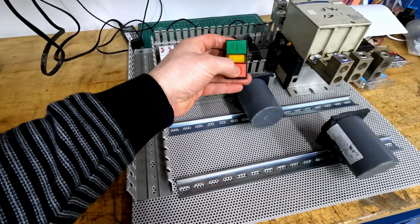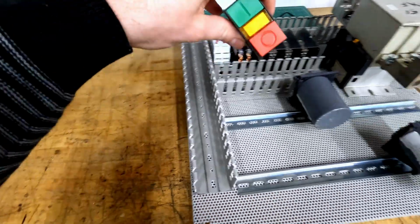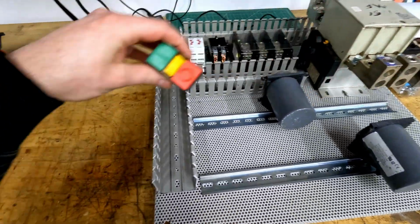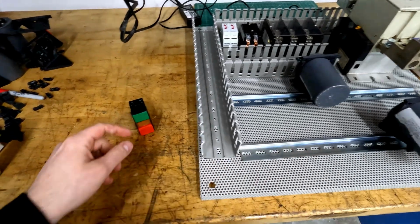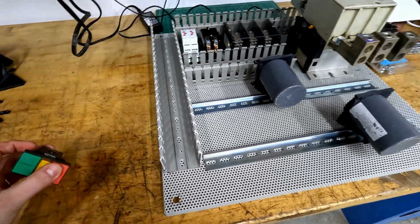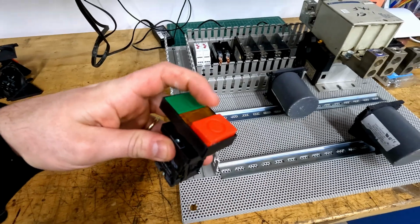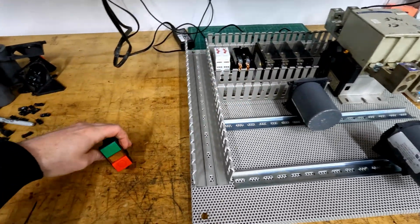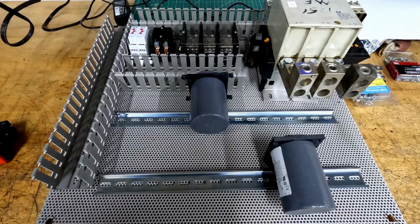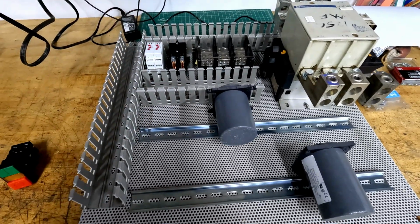For now, I'll have the main controls off to the side here, just laying on the bench. There will be one mounted on the face of the box, as well as one mounted on the wall somewhere in my shop, so I can start it either from inside the phase converter shed or in the shop. And I'll use this indicator light here on the 3rd generated leg, so it'll only illuminate when I know that I have the phase converter running. I'm going to go ahead and get everything fastened and then begin wiring.